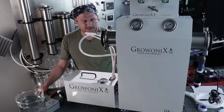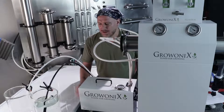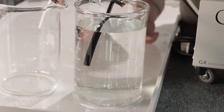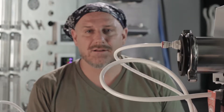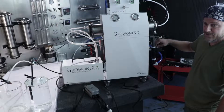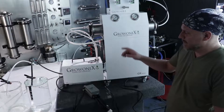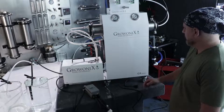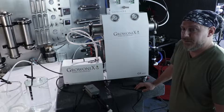This unit is ready to be initially started up and purged. We've been flushing for 20 minutes now at line pressure, and you can see the water is already a lot clearer than it was when we started. The membrane storage solution is almost out of the membrane, and now is a good time to hook up mains power and turn this thing on and tune it in. Before we hook up the mains power, we are going to turn off the manual override on the solenoid valve. You heard the pressure switch disengage — the pressure gauges on the RO have wound down to zero, which means the solenoid valve is closed, the unit is depressurized, and now is a safe time to hook up the mains power.